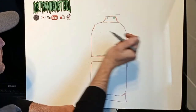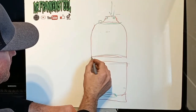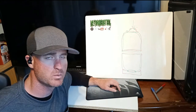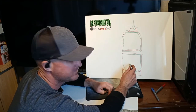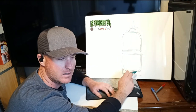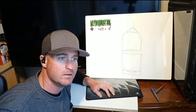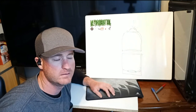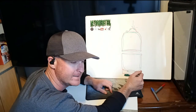If worse comes to worst, you can always weaken it with a spade bit like I did. You have to be careful with acetylene tanks because they are explosive, and sometimes the core is made from asbestos — very dangerous stuff. If you know it's asbestos inside, I wouldn't even cut it open. Give it to someone that recycles tanks or to a welding supply store — they'll know what to do with it. It's just not worth it. If you just want a tank, look for a propane tank or a CO2 tank. Those have nothing in them — you can just empty the gas out, and even if it's an inert gas it's not going to explode. Propane still requires precautions, but it's not as dangerous as an acetylene tank and it doesn't have any porous material inside. Acetylene tanks are the only tanks that have anything in them.